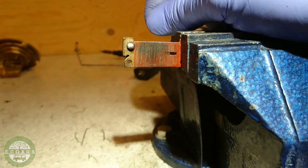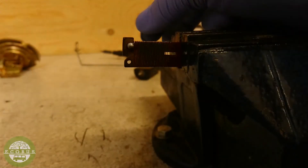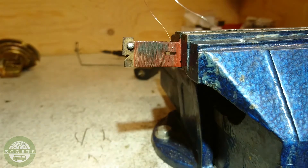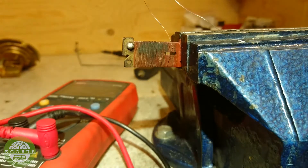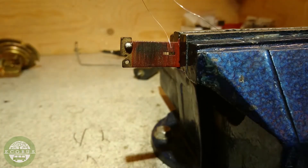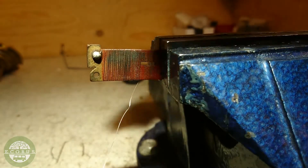This one's too short. I could wrap it with a little bit more space, or I could have a longer wire — I need about one third more. That would mean if I just measure resistance I would need 90 ohms. So what I'm going to do is remove this wire that I wrapped and wrap it a fourth time. But I won't cut it before I wrap it this time.